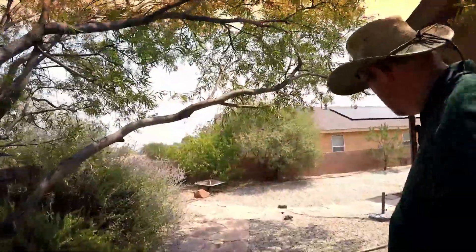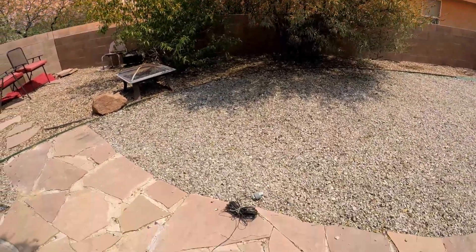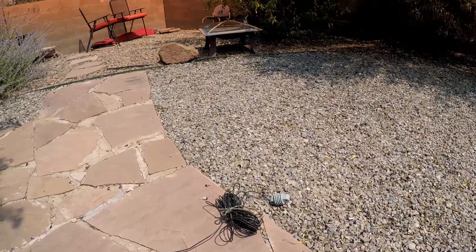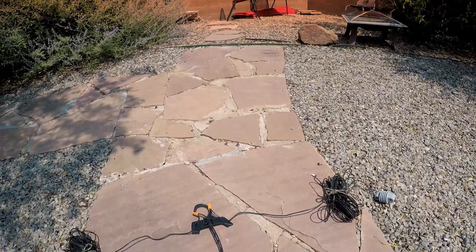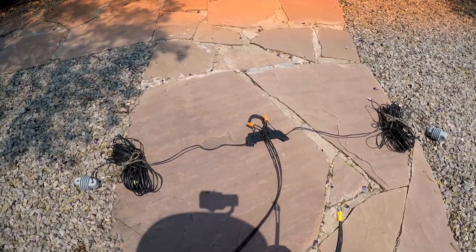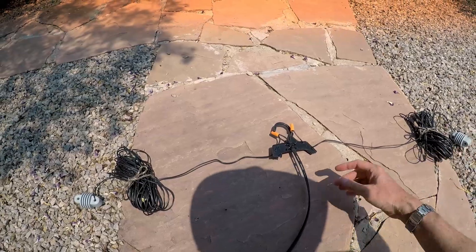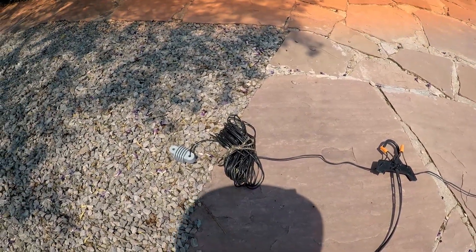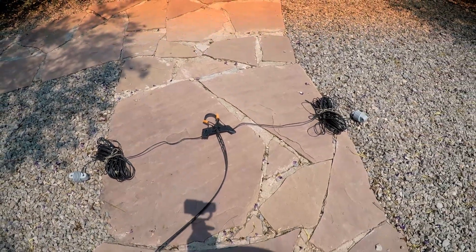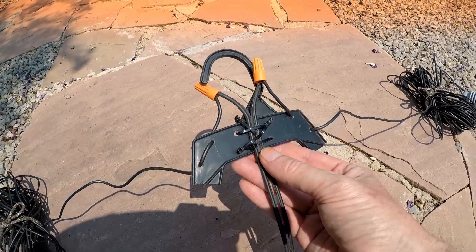Speaking of HOAs and antennas, I've got a new one I'm working on. It's called the Coat Hanger Antenna. Here it is in all of its glory — I haven't deployed it yet. I got the design from the ARRL Small Antennas for Small Places book — a really excellent book, I'll leave a link in the description. They give you plans for a doublet antenna fed with 300 ohm ladder line, with regular antenna wire and some insulators on the end. The center support is any kind of insulator you can find, and I found this unused coat hanger. Hence the coat hanger antenna.